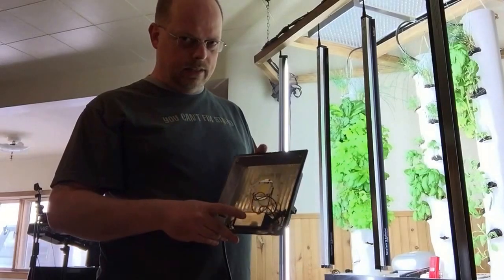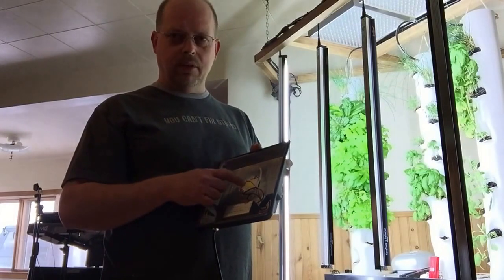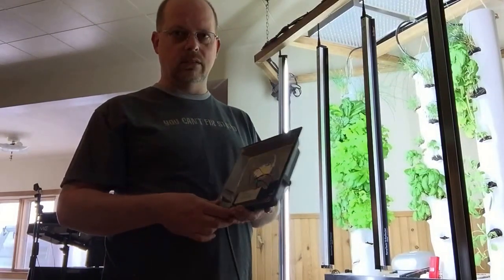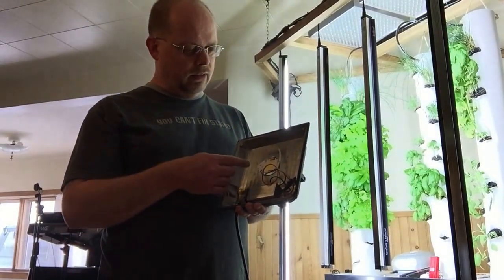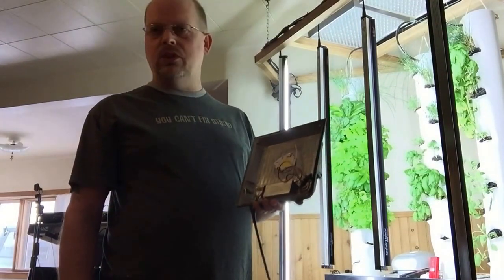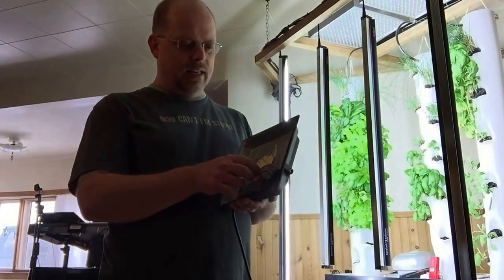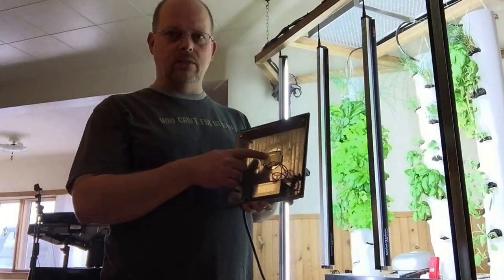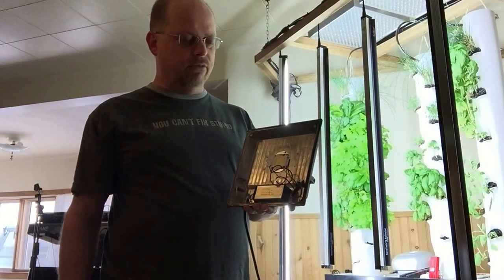This whole assembly, this LED driver and the chip, you can buy this off of eBay for $8. Complete. This driver, if they adjust it for this chip, I'd be really surprised. I'm thinking they just take a little 30-watt driver and mix it with the 30-watt chip and hope for the best. Because this one was just replaced 4 months ago and it's already dead. And it's the driver itself that went bad. I used a meter and checked the LED chip and it's perfectly fine.